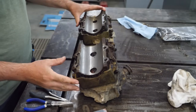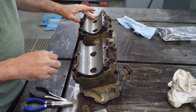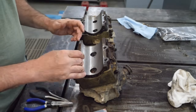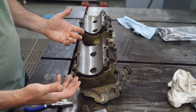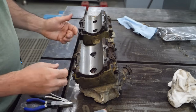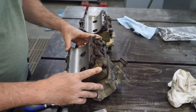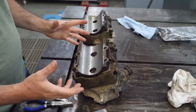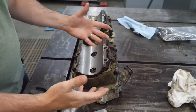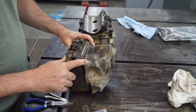I've got both of these off now. They look pretty good. There is a little bit of corrosion under the edges and some very minor pitting inside here. The inner mating surface that went onto the spar tube or the spar fitting looks really good aside from very minor defects. It's just visual at this point and we really need to dig into these further. The next step is going to be to take them apart, disassemble the lower half and the upper half, and take off that chunk of Sabre crankcase.